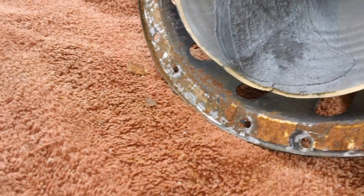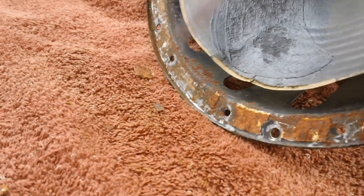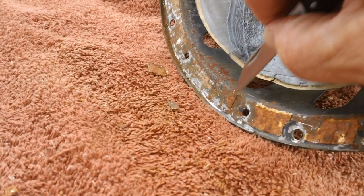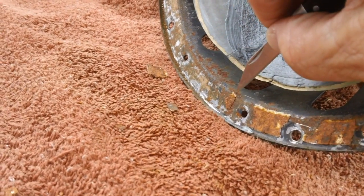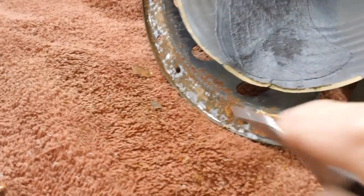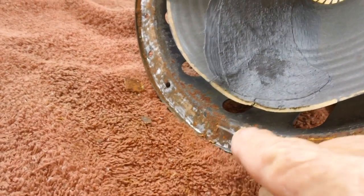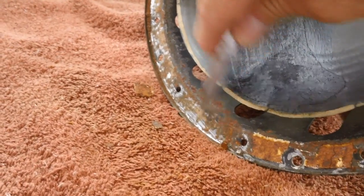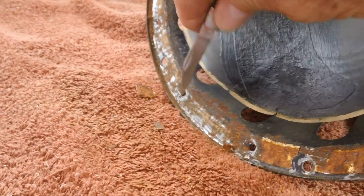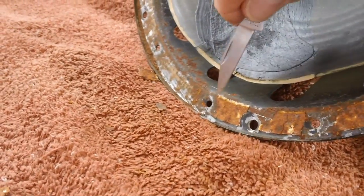Then we go over it with sandpaper until it's nice and shiny. Don't use real fine sandpaper - get down there with some gritty stuff. You're not going to sand through this metal with a small piece of hand sanding done by a small piece of emery cloth or something like that. Don't be afraid - this is rust and crap. Get it off there, scrape it on down, do the best you can. Then you turn your speaker around and do it again.